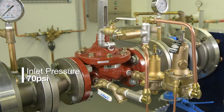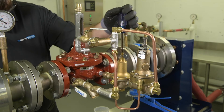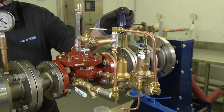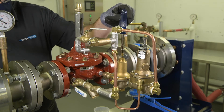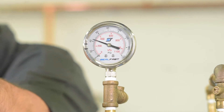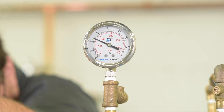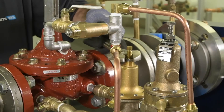In this example, we'll be setting our downstream pressure to 50 psi. To set the pressure-reducing pilot valve, slowly tighten the pressure-reducing pilot adjusting screw clockwise to increase the downstream pressure. Watch the downstream gauge as you tighten the screw. Small turns of the adjusting screw can result in large changes in pressure. Once you've reached the set downstream pressure, tighten the locking nut.